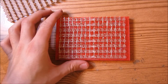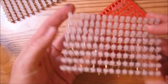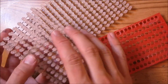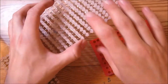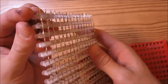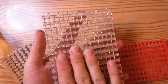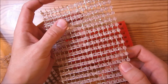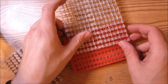Once the glue is all dried up, pop this section out as well. Right now we have a big matrix and a smaller matrix. To join these two together, point all the LED pins up — all these LEDs are bent and soldered pointing up. Put four LEDs into the LED frame with this side pointing up.